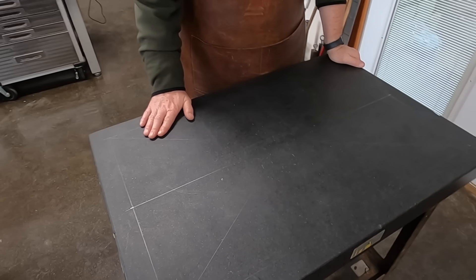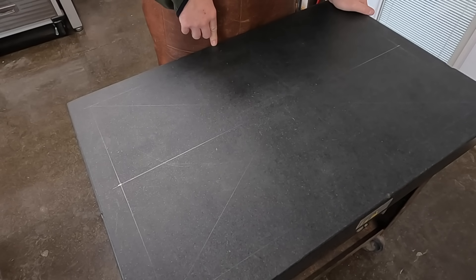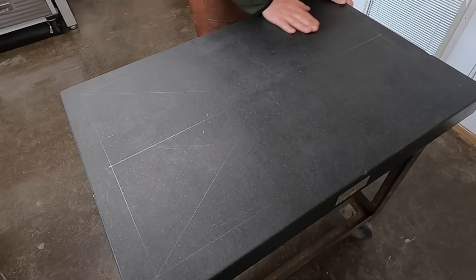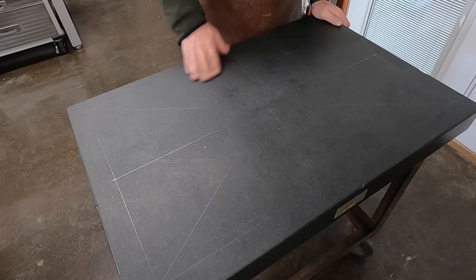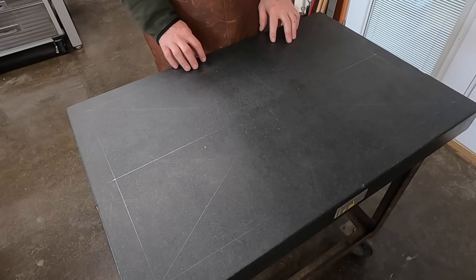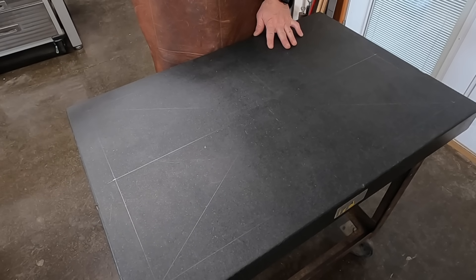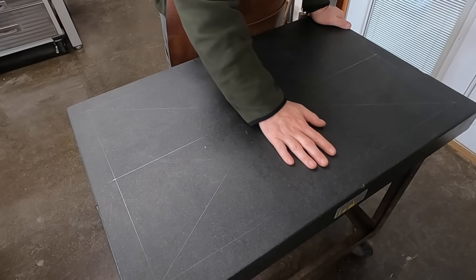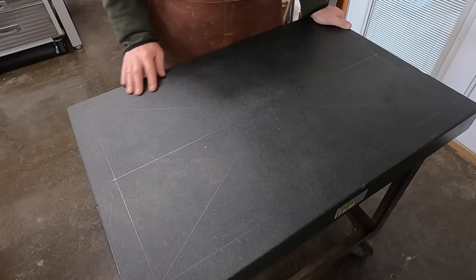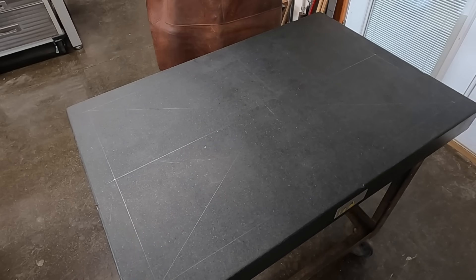Adam's got the camera on the reference side of this plate — you're looking at it just like you were on the computer. I'm on the back side of the plate. It's obvious that whoever was using this plate was using it fairly heavily in this area, a little bit down here, and quite a bit back here — so most of our wear low spots are going to be here and here. Just about every used plate I've seen has a very similar pattern. My big pink granite was exactly the same way — the big hole was literally right here.